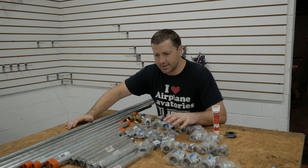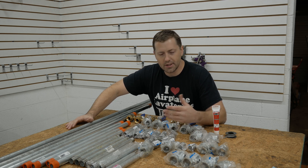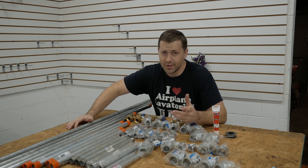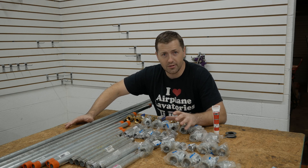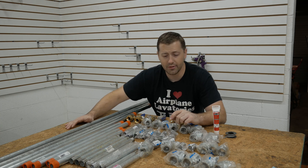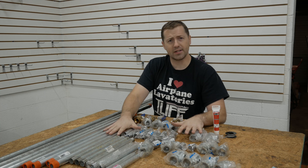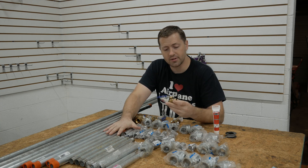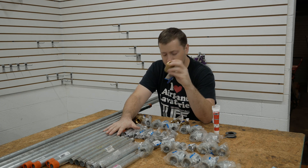As you can see here, everything is galvanized pipe — not black iron or regular cast pipe. The reason is because of the moisture content running inside the pipes; it will eventually corrode. I'm not saying I need it to last 40 or 50 years without replacing the air supply pipe, but I'd like it to last longer than the black pipe did on the compressed air dryer. We're going with galvanized — it's the only thing I recommend if you're going to use hard pipe other than copper. Copper is a little more volatile when it comes to pricing, so we priced everything up in galvanized. The ball valves are brass, again for their non-corroding and non-rusting properties.